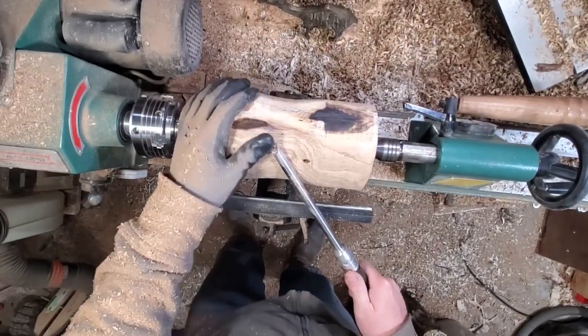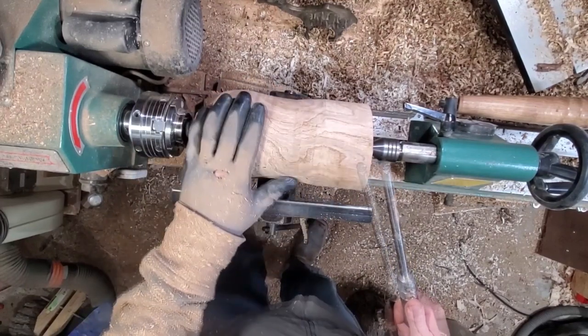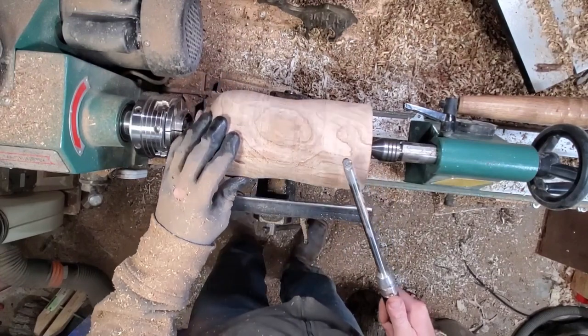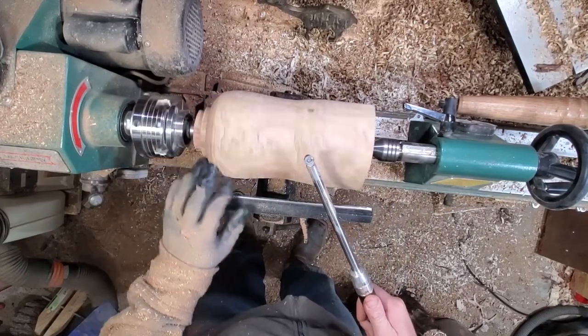I had to pause for a minute to sharpen up my carbide. This mesquite is some very dense wood. I want to do my finishing passes with traditional tools, but I don't want to keep going back to sharpen, so I'm going to do most of my roughing work with a carbide — because my carbide is actually giving me pretty good cuts on this wood.